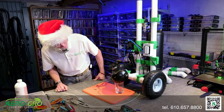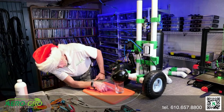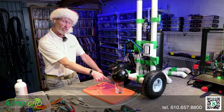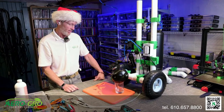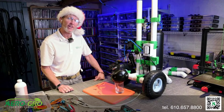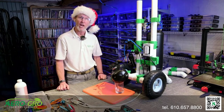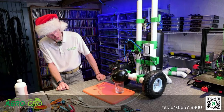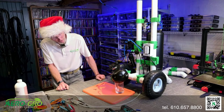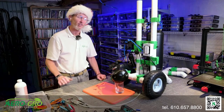So that's about done dripping. I'm at just over 100 milliliters here, so I must have had a little extra oil still in there. And now it's all out. You can be very confident at this point. That's why we measure it: once you hit that 100 milliliters, if that's what's in your pump, you've got it all. I am going to let it drip a little bit more, because it is technically still dripping. I want to do that till it just won't drip anymore, and then I'll add the glycerin back in.